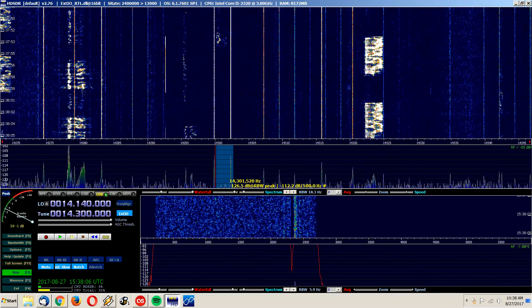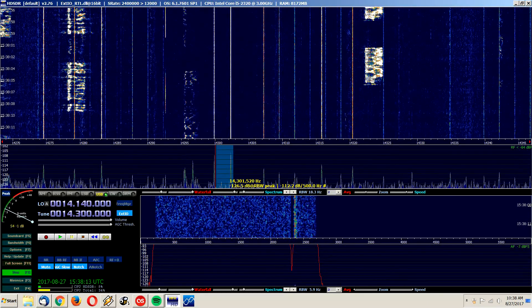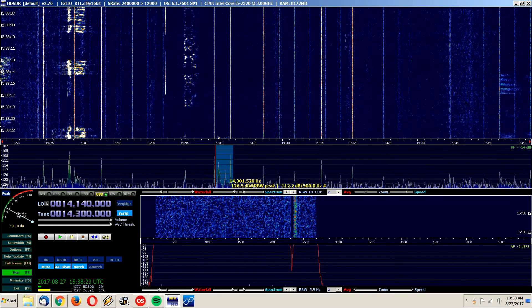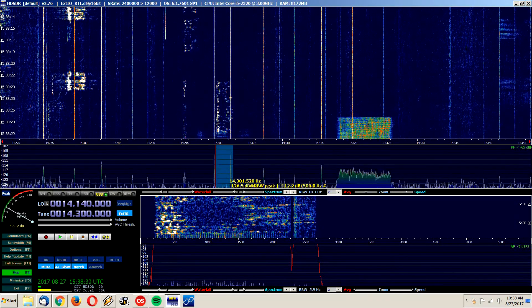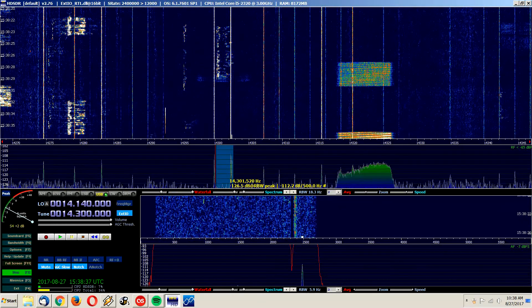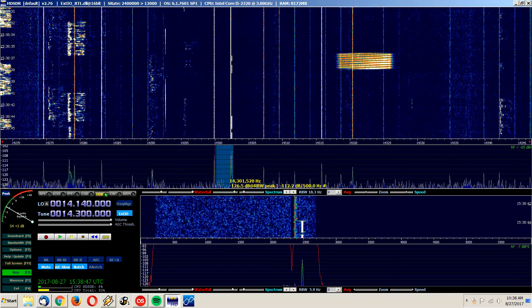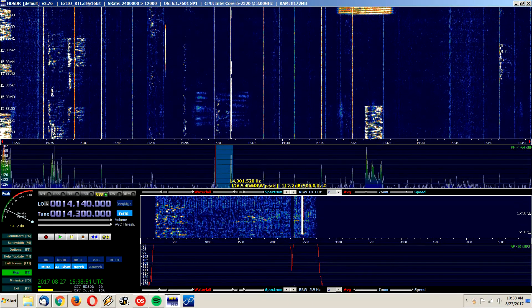Out of irritation, probably is the better word, I tried to set up a second antenna. I tried a couple different setups, and right now I'm using an off-center fed dipole. I've got it up on the painter's pole, it's about 12 feet off the ground. I got the two wires attached to a 1-to-1 balun that I had — to tell you the truth, I can't remember what I had that thing for. It was in with my antenna accessories and parts box. I'm using it temporarily for my off-center fed dipole until my center insulator arrives in the mail.